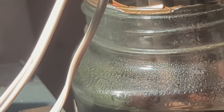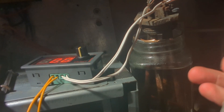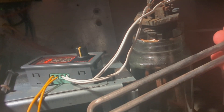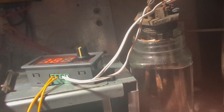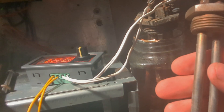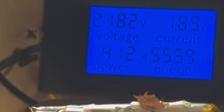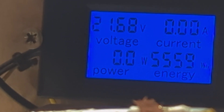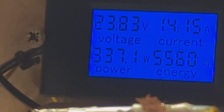I need to correct myself because I'm now in the possession of two dump loads. I found this one in the garden — it's a 300 watt 24 volt. If you stick that up to a fully charged 24 volt battery, it should give you around 300 watts. This one should be 600, but I'm not sure — you can see it's got two, it's essentially two of these in one. It's starting to rain a bit, which sometimes does have quite a negative effect on the turbine, I'm not sure why.